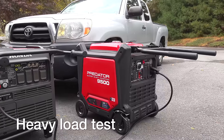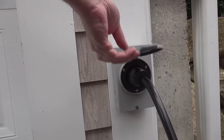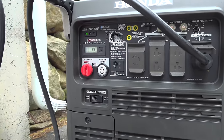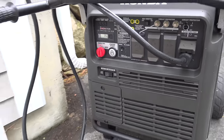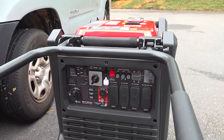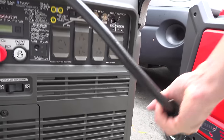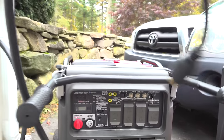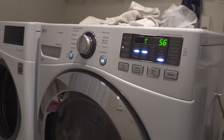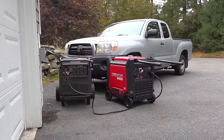Here I'm trying another test — I've got my Honda EU7000i right next to the Predator. Ironically, the day after I got the Predator we lost power for three days, so I switched off the Honda after the first day and fired up the Predator. The Predator maxes out at 9000 watts compared to the Honda at 7000 watts, and I wanted to put that extra power to the test. My Honda can't run an electric dryer without overloading since those things usually use around 5000 watts alone — so I turned the dryer on, and the generator didn't miss a beat. The dryer worked perfectly.